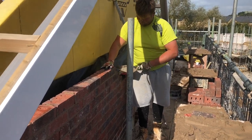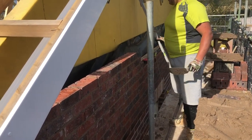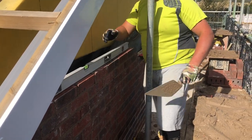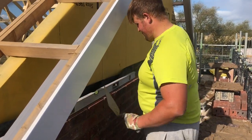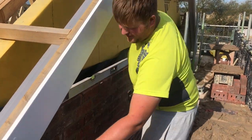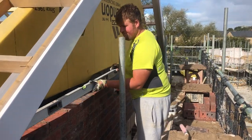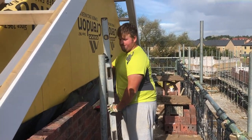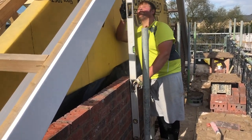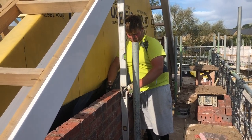Anyway, today we're just building these timber back cut-ups — timber top outs, spandrel panel, smart roof, whatever you want to call them. I prefer these over blockwork on cut-ups. Blockwork is just a wind sail — you're up there high, the blockwork catches the wind, your whole cut-up's moving. Tie wires and pointing the back is a massive deal, I hate doing pointing the back of block cut-ups. With timber fixings you just bang them in — no issue. I'd rather do these every day of the week.